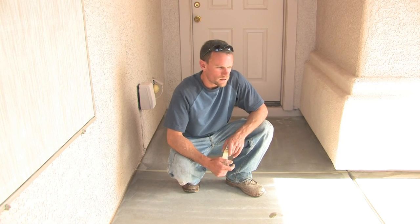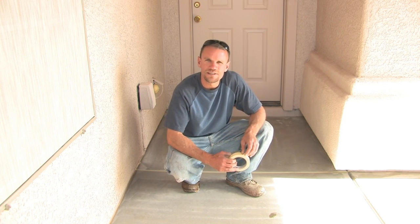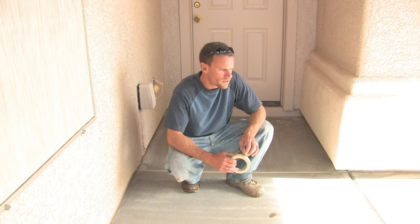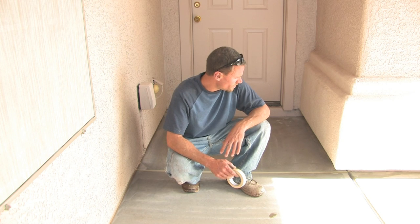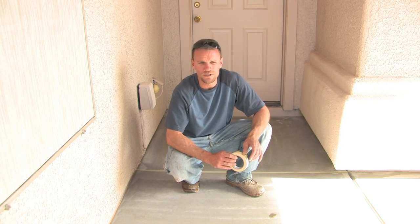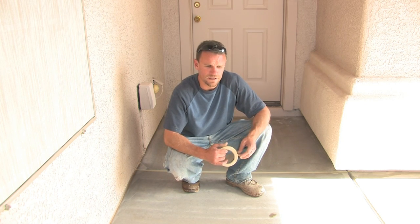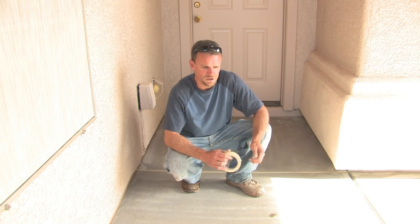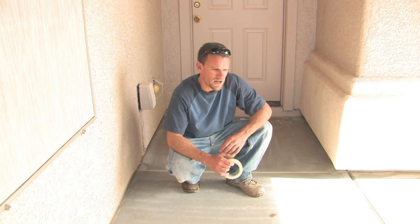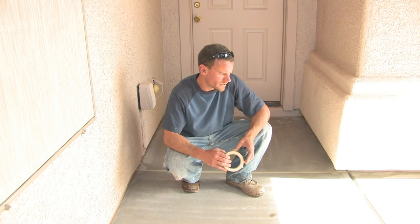We're going to be doing a concrete overlay — a simulated stamp done by trowel that looks like an Italian slate stamp. You get the texture from your trowel. After properly preparing the concrete — acid washing, neutralizing, and pressure washing to clean up the pores — you don't ever want to fill the expansion joints with concrete. Even though this overlay is flexible and stronger than regular concrete, the movement will cause it to crack and delaminate at the expansion joints. So I tape off my expansion joints to pull the excess off, then tie them in when you go to stain it so the whole overlay ties together nicely.